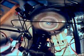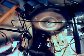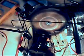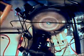Now I can use it because we can hook up the small motor. And it will run for small amounts of time. It does appear it's just turning periodically, and the cap builds up enough charge and it'll turn again. So this is probably too high of a load, because it drains the caps every time. The cap is back to 4, slowly climbing back up. Let's get my probes back on. Back up to 5, and then up to 5 volts again.